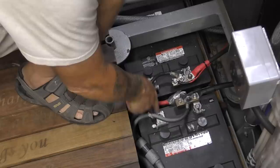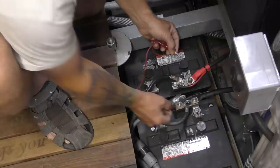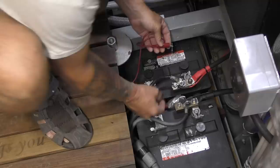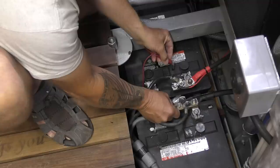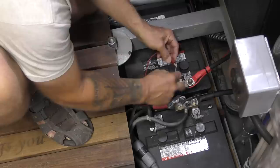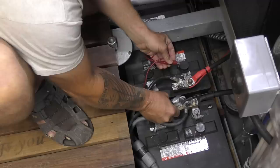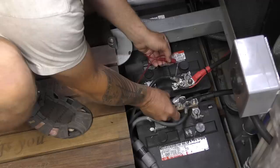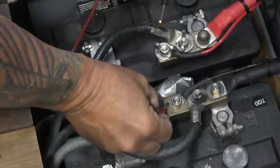These batteries down here are 24 volts, hundreds of amps - two big 12-volt batteries tied in series. That should throw a good spark - wow, it's working even with that amount of voltage. Now this is negative going to positive - that should arc. Yep, sure enough. Now turn it around - it doesn't arc in the correct direction. That is a hardy piece of electrical equipment. Now I'm told that these fail - they typically fail closed. As long as the band is facing toward positive you don't get flow; put the band away from positive and you get an arc.